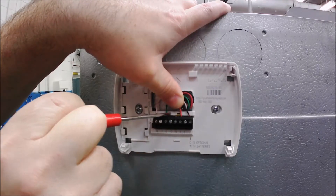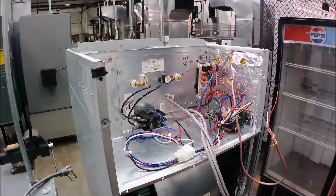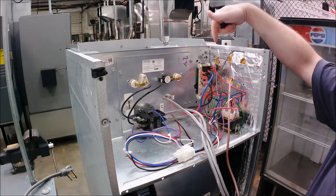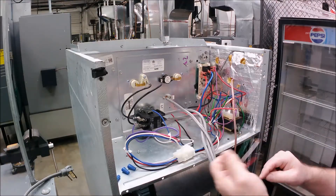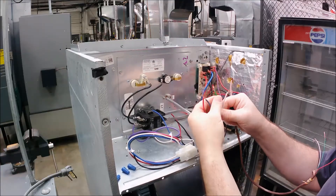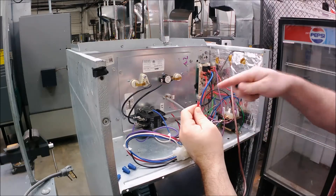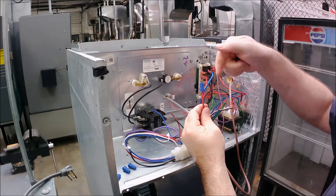The R and RC are both R's, so they're linked together with a little brass tab. The black wire I use for common goes on the common terminal. Now I've got the top plate off for clarity — in the field you'd run thermostat wire through a knockout on top. From the factory I've got my hot, common, G, and W, and I'm basically going to attach wire for wire. We don't need a float switch on this heat unit, so there's no safety device to wire in series.